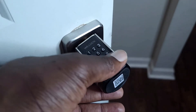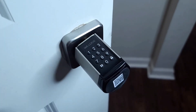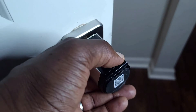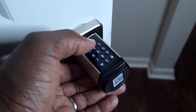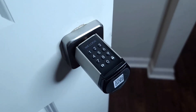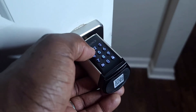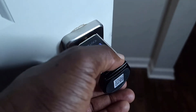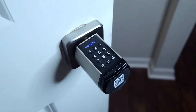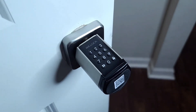To get this configured for regular use is really simple. The default passcode is 123456. To clear that default admin passcode, press the padlock key twice, then put the default passcode in and hit the padlock key. As you can see it's flashing. Now to change it, you'll put your new code in — one, two, three, one, two, three — then padlock, and do it again. So now the admin passcode is different. That's how you clear the default one.